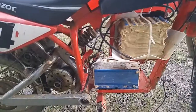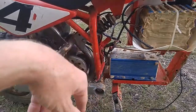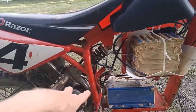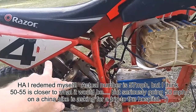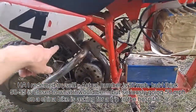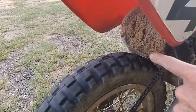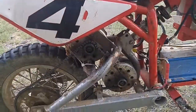I'm pretty happy with it and I can't wait till I get the AC setup and put it in a bigger bike with an AC controller. I'm also thinking about getting a 72 volt controller and building another pack — then I'll have 89 volts. Doing the hand calc, going from 60 to 89 volts, if I'm doing 38 right now I should be at 55 with the same gearing. I could go faster if I made the gears bigger, but I'm running out of chain clearance, and I can't roll the motor back because it's already tight, so that's it.